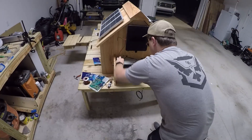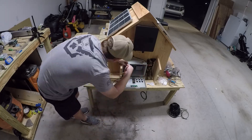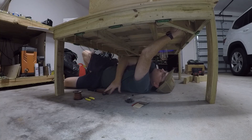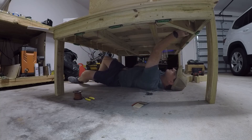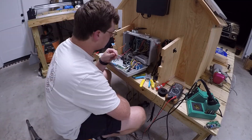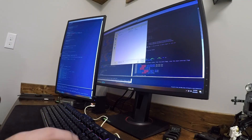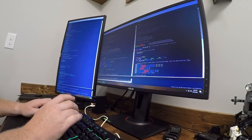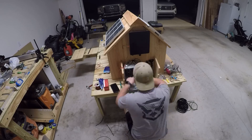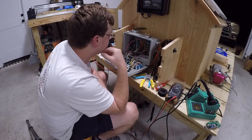Before packing up and heading to Crimson Oak Farms we needed to finish connecting all of the external devices to the electrical enclosure. Wire management is very important here since there are a couple different voltages leaving the enclosure — we do not want to cause any noise in our analog or I²C signals on our microprocessor, the Teensy 3.6. We have GPIO for up to 64 digital IO pins, 22 of which have PWM capabilities, up to 25 analog IO pins, and communication protocols like I²C. Digital signals are a true/false on-or-off type signal; analog signals are more of a continuous signal and this microprocessor has a default resolution of 10-bit. Our barometer and LCD screen communicate through the I²C bus — they are on the same bus but have different addresses.